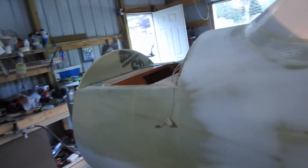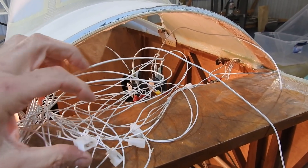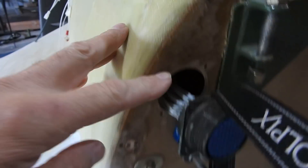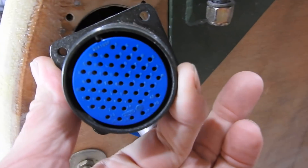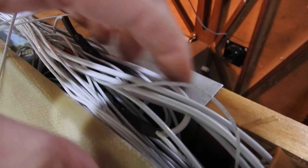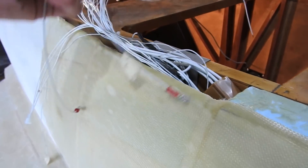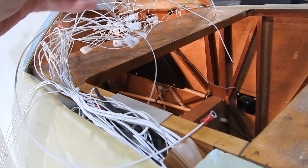We'll come around here to the front of the assembly. I put in all these connectors — once I get the panel in and get this stuff all plugged in, this will all be tie-wrapped up. Those are all pretty much labeled as to which ones they plug into. I also had to run six more wires out to here and put in all the remaining pins to get this back together. I still have a lot of pins left if I need to add anything else to the engine. The computer's down in there — this is the bracket for the computer. It's the EEC relay that powers up the whole computer. And then these are the starter wires. I think that's the fuel level sending unit.